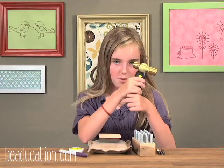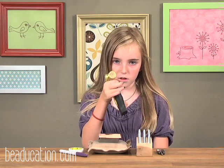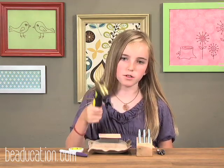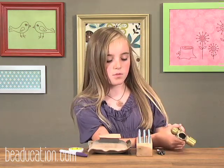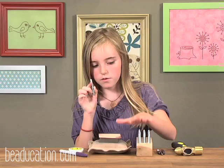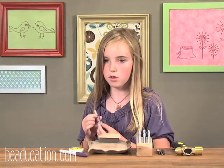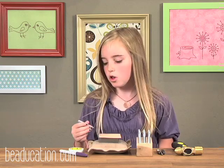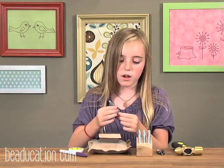So now it's time for the stamping. We are going to practice stamp. Basically to hold the hammer, you do not want to hold it up here because it's too close. You do not want to hold it down here because it will have too much of a whack and it will be harder to bring it up. So for this hammer I will just hold it right in the middle. For the stamps, I'll grab this random A. One side of this kind will have an A — otherwise some have a groove or a logo on one side. That's where you put your thumb, or else it will be upside down.